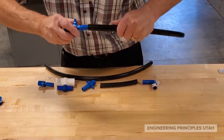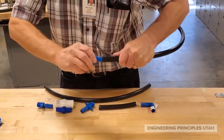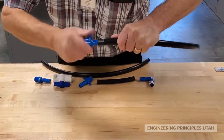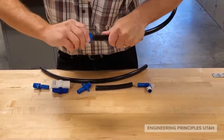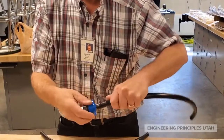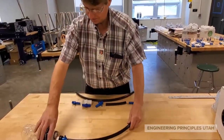This fitting has a thread for a barb and it just rotates into the pipe with a little bit of force. You want to go until the last two ribs are covered — you may have to give it a little squeeze as you rotate. Those handles are why I thought these are the best ones to use for rotation. That makes a nice seal.